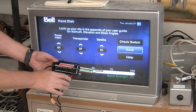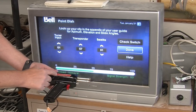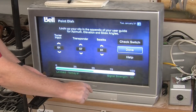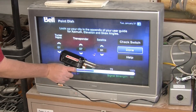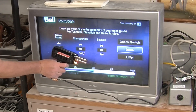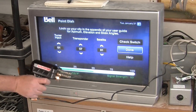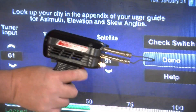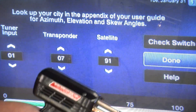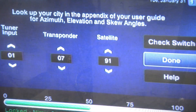There is one other common thing you can use to generate a field to demagnetize things, and that is a soldering gun, because it essentially has a great big coil inside and current flowing in a loop. There are lots of stray magnetic fields. Let's see if we can see it on the TV — there's some of the reds. So it's not nearly as strong as our purpose-built CRT demagnetizer, but we can essentially achieve the same thing just by gradually moving it away from the screen. One thing I should point out is it's not a good idea to be playing around with something like this if you aren't sure you know how to properly demagnetize the screen, because you might end up with a CRT with a color blotch on it.